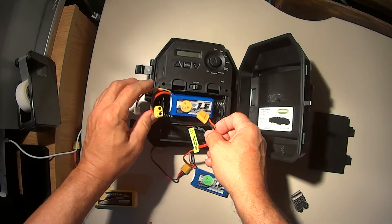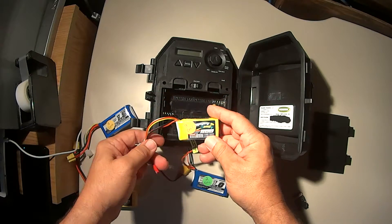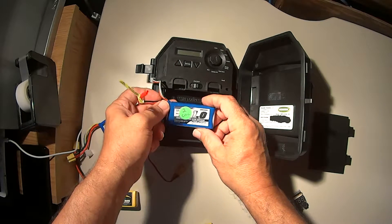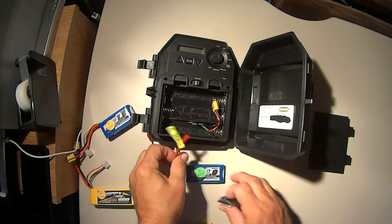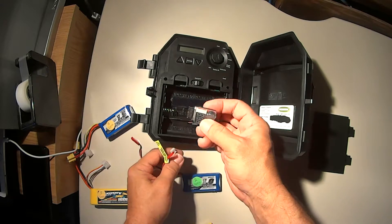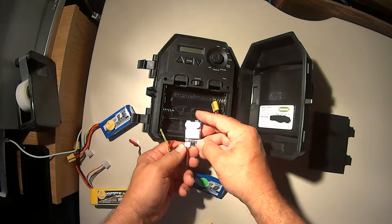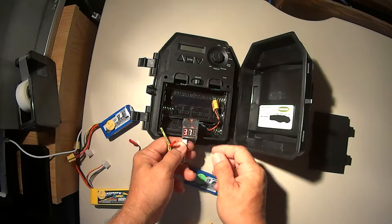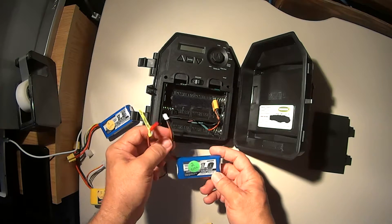That was a three-cell. I have a smaller one that would fit in there perfectly. This one here is a 500 MAH and this one is a 1000 MAH two-cell. But this is the one I've been going with and it's been working really good for me — it was out there for two weeks. I keep this little battery checker to check the cells; it's like a dollar item you can find on eBay. Just plug it in and it'll tell you: two cells together 7.4 volts, each cell 3.7. So it's pushing out about seven and a half volts right now, and it's been out there two weeks — still good.